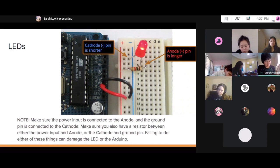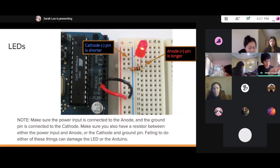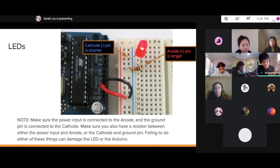In the middle of the breadboard, we have little groups of 5, a bunch of rows of 5 pins on the width. If I connect this LED into this pin here, it'll be connected to any of these pins here on the bottom, but not the ones here. So it's electrically connected to these 4 here, but it does not cross the middle. Basically what you're intended to do is have your power source along these side rails and then have all your circuitry in these middle little rails.